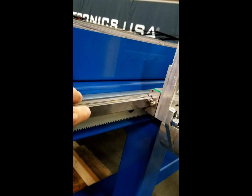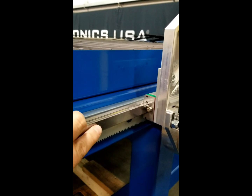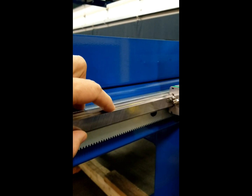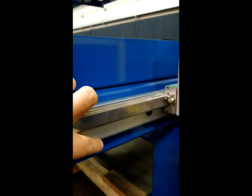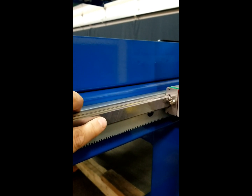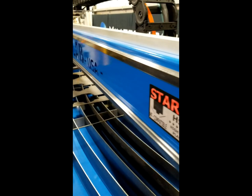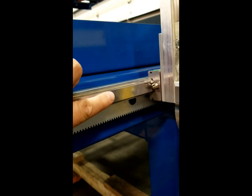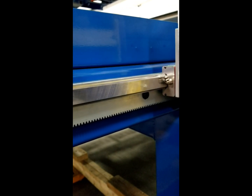This is the hardest rail to really integrate because it has tapped holes in the back of it, but we thought, let's do it. So we have custom-made gear rack, and we hold this rail in a precision way so that the pitch line of the gear rack is perfectly parallel with the pitch line of the rail. All our rails are like that — whether it's these rails to the gear rack that is hand-indicated, or these side rails, whether they're the black rail or this bolt-from-the-back linear rail.